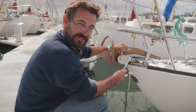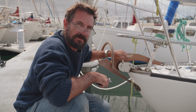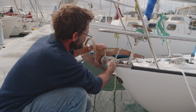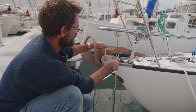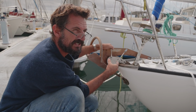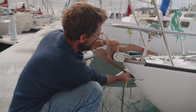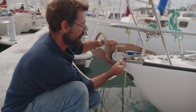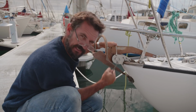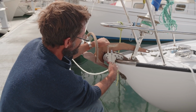We'll just put the finishing touches on our revamped bow roller. So this has been a little bit of a progression. With a Kiwi-style bow roller, the initial roller was back here, and we've had to fabricate this bit of metal add-on just to bring the bow roller out a bit. But it's a bit of a compromise, bringing this out more to accommodate one of these new modern anchors, because with the old bow roller you can see we've dug into our bow. So there's a compromise between getting that out enough and not putting it out here and increasing the leverage that our chain would have when we're anchored and just tear this whole thing apart. So we've extended it out here.